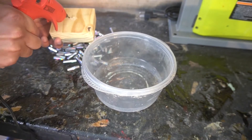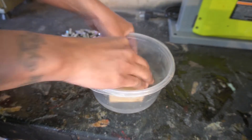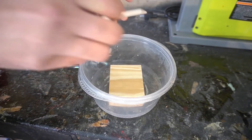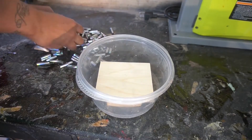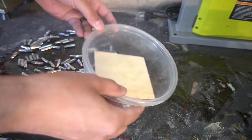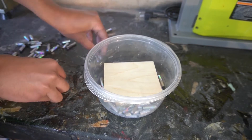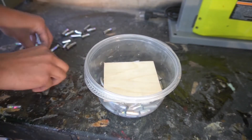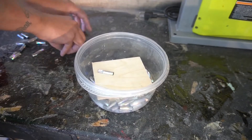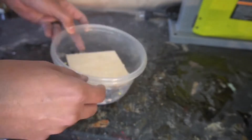Got all the little pieces built the way that I want. Took the glue gun, getting the waste block in the bowl. This particular project isn't very big — I didn't have a lot of pencils to begin with — so I knew the bowl was going to be shallow overall. Here I am adding what I'm thinking is going to be a backstop to prevent these things from floating, since wood will float when you put epoxy in it.